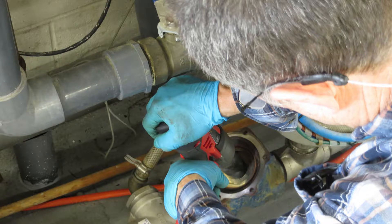I like to use a cordless impact gun to remove the nut but you can also use a half inch breaker bar. If it starts to round the bronze nut then just stop. Make sure the socket is fully down on the nut, and if you have to use a hammer to hammer it down to make sure it's tight, go ahead. If that still doesn't work you can heat the cast iron body of the valve around the threaded area with a propane torch. Make sure you just heat the valve body and not the nut plate, then try again to remove it.